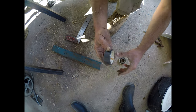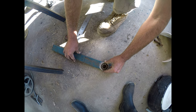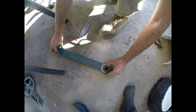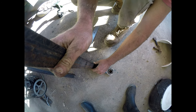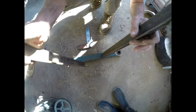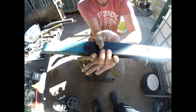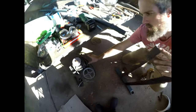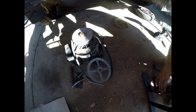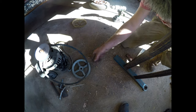I've cut a piece of tube pipe for the bearing to sit in — that's going to get welded onto there. This is the arm holding the bottom; that holds the shaft there. Then we're going to have two legs coming up here like so, and then the top will sit on there. And this motor gets bolted to these bits of angle iron with the pulley off to the side.